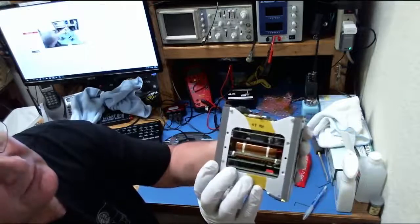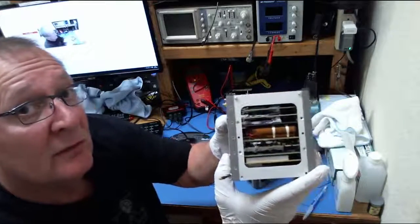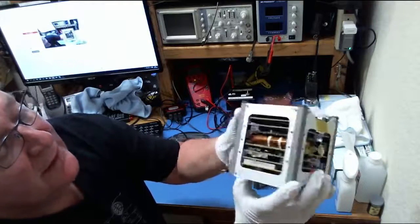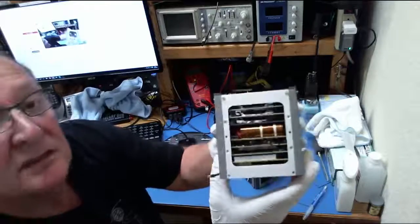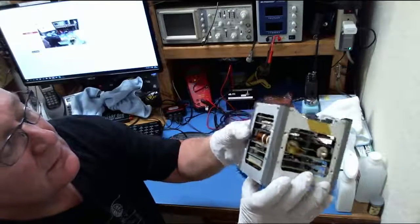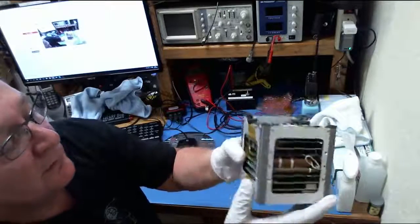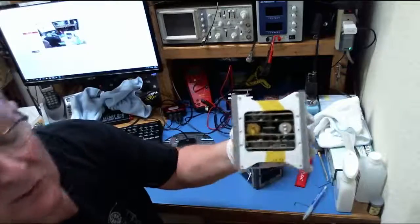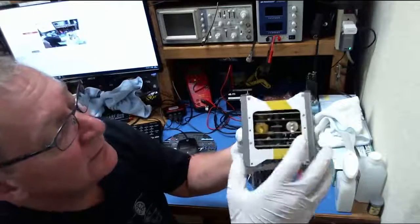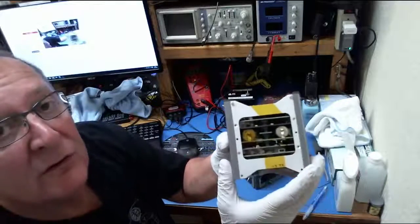Those are NiCad cells. We chose NiCad because they have a long history of several thousand discharge and charge cycles. This kind of bronze looking stuff around them is actually a heater. It's a little element wrapped around it so that we can heat the batteries if they become too cold out there in space. You need to have 0C or higher to charge the NiCads, otherwise you're going to harm them. Running right down this minus Y side, you'll see the bus connectors.